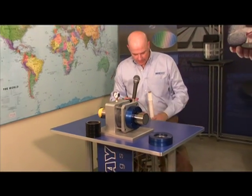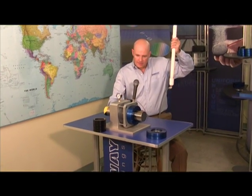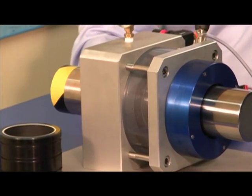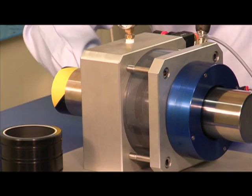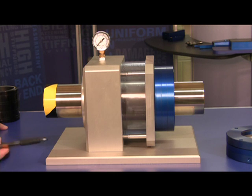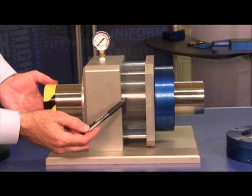In this case, I've got a tube full of water. I'm going to raise it up and give it a little head. You'll see the water start to flow into this plenum here. Once it gets up to the bottom of the shaft, you'll see the air that's coming out of the air bearing start to leak in. The plenum continues to fill with water. You can see that the water level is above the top dead center of the shaft.